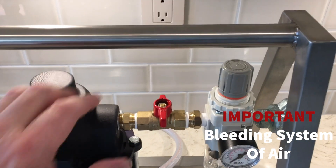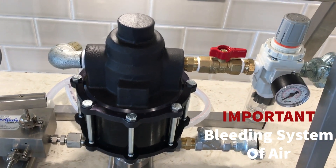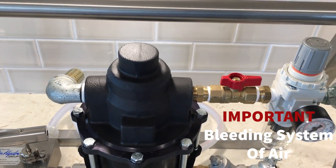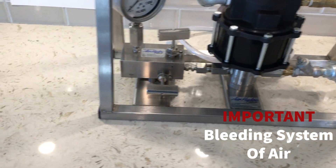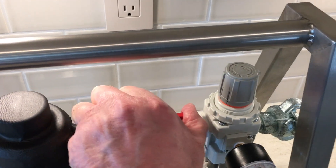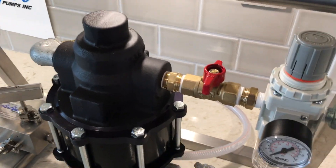You can start the pump by opening the pump start/stop valve, and the pump will start to reciprocate. Fluid will be pumped out of the unit through the hose and the test specimen until fluid starts to come out of the vent valve fitted to the test specimen or the test plug. Once you see fluid coming out of the test specimen, that will indicate that all air has been purged out of the system. You should then close the pump start/stop valve to stop the pump.